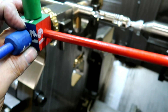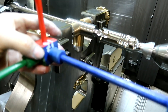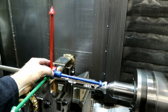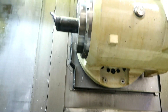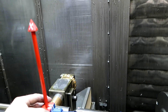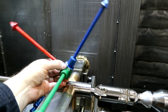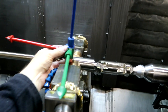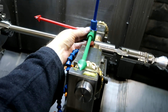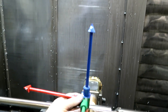And on this machine, of course, you're going to be working this way, but when you have the spindle — that spindle up there vertical — you actually rotate the coordinate system in the program so that you lay it back this way. So now the X plus is traveling towards the spindle, and the Y plus is still traveling outward towards the front of the machine, and the Z would be up.